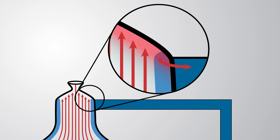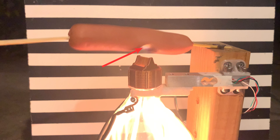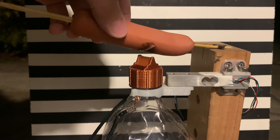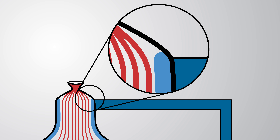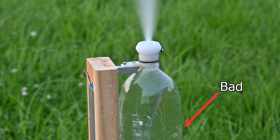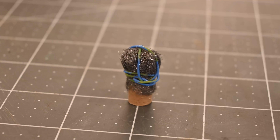If you want to see an example of a stagnation point, you can look at one of my older videos where, to demonstrate the danger of these whoosh rockets, I just fired one at a hot dog. There you have it - a stagnation point on a hot dog, where the abrupt stop makes the pressure and temperature much higher, making the gases easier to see. As a side note, stagnation points aren't a great thing to have on your skin. I think eventually the flow will stabilize and the stagnation point will go away, which would be easy to test by pumping a bunch of air in. But before I do, I'll have to make a diffuser, because without one the incoming air can just blow the film cooling off the walls - so I printed out a little nozzle and wrapped some steel wool around it.